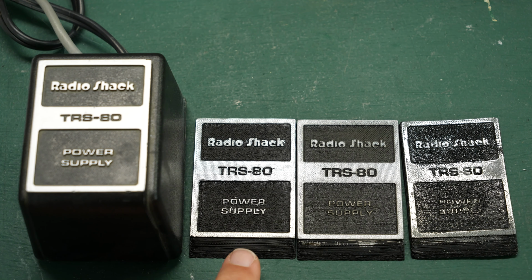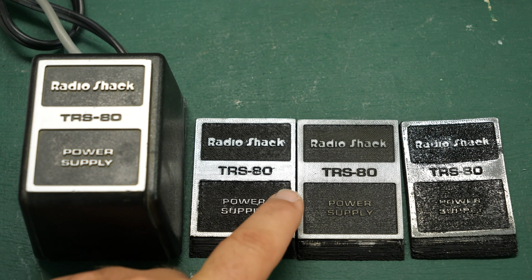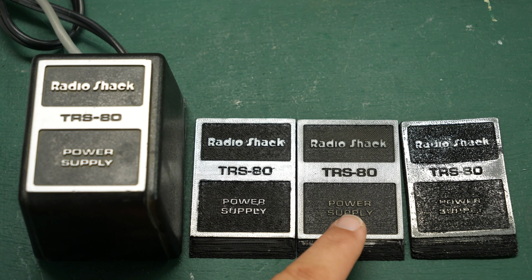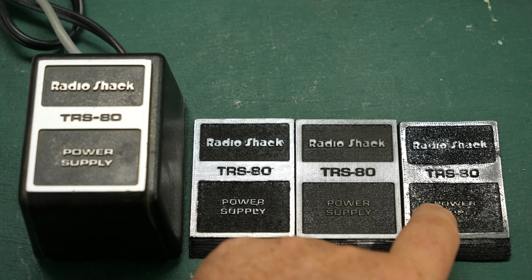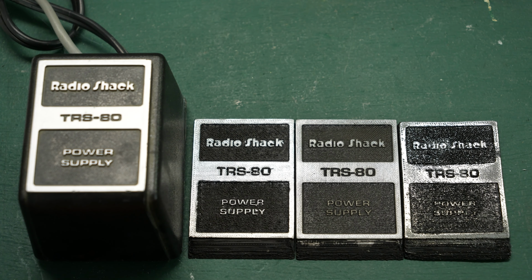So here I've ranked these from best to worst. This is the original. This is the paint pen, which I think worked out the best, and you can do multiple coats if you want to really make that stand out. But you do have to be a little bit careful, obviously, so you don't end up getting paint down on the lower relief areas here. This is the paint and then laser method. You paint the surface and then laser down. That's probably my second preference, still not great. And of course, the worst one is the embossing. This method, at least in this case with these materials, isn't going to work. So my recommendation after all these tests is to just go ahead and buy one of those paint pens. They're not very expensive and the results look great.